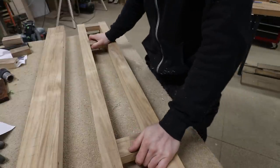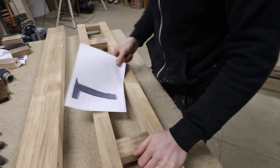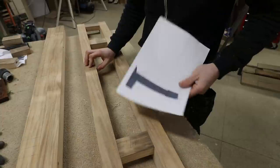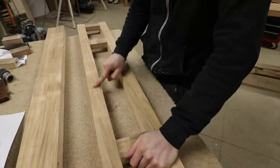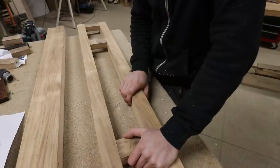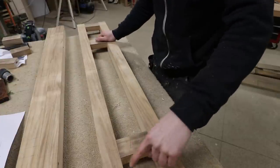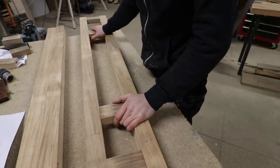Okay, so that's our current stage. So what I'm going to need to do is put a panel in the centre of the post. So I'm just going to set the groover up to the thickness of a panel, which is 9mm birch ply, and set it from the face, and then machine all these components from that face the setback that I want. So I've used a 12mm setback on all the panelling on this job, so I'll keep it the same on the fireplace as well.